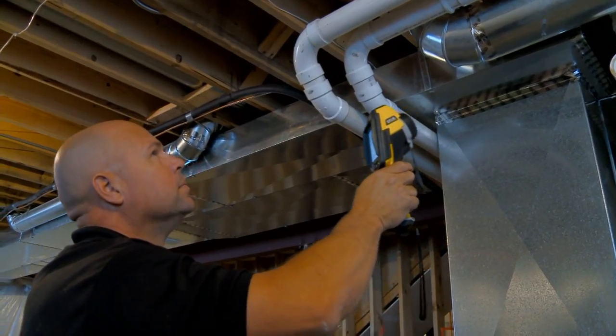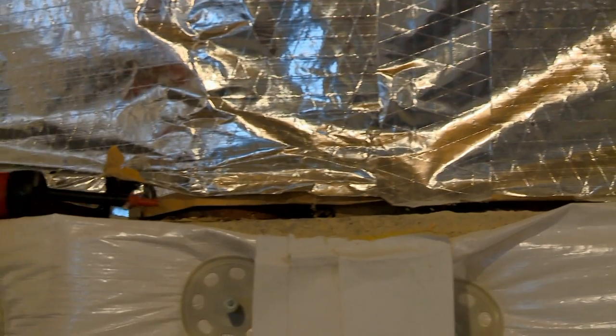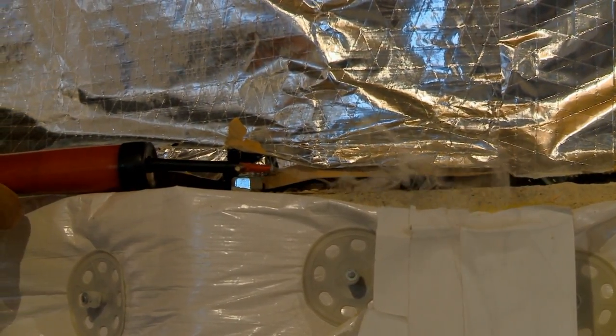In the southern climate, where you're in cooling conditions most of the year, it's the exact opposite — you want that control layer on the outside of your insulation. You need to understand where you're building and where it's appropriate to put these layers. The type of construction and the exterior of the building also have an impact. Depending on your exterior cladding, a permeable or non-permeable membrane might be desirable. You have to understand where the moisture is trying to get from — outside into your building, or warm humid air in winter trying to get outside — and understand the interior versus exterior environment.